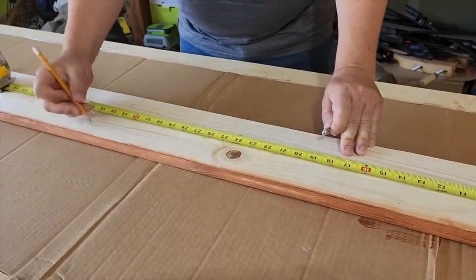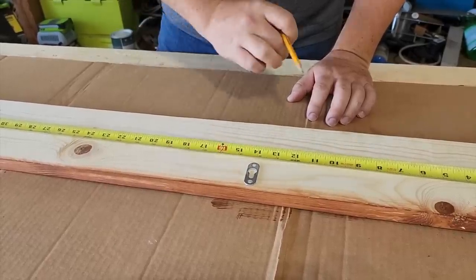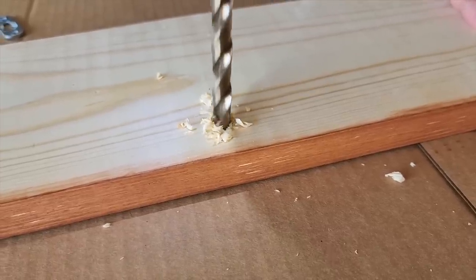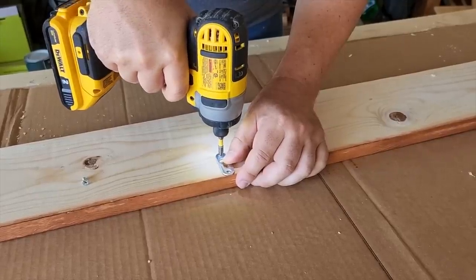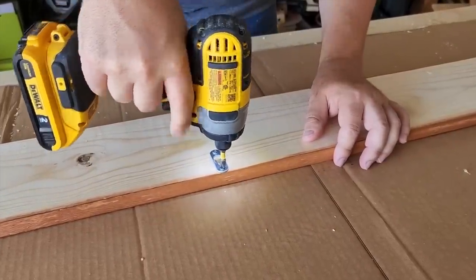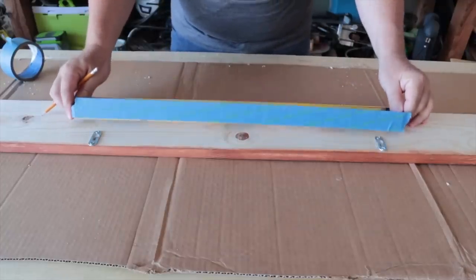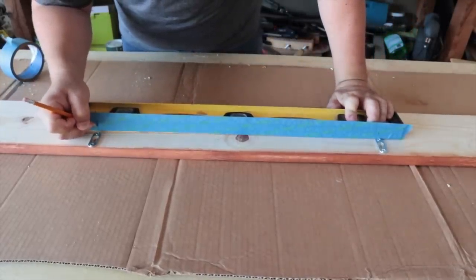The next step was to put the hardware on the board that would hold it against the wall. I wanted the board to be flat and not sticking out like normal hooks or hardware. With this hardware, you go ahead and mark it on the back of the board and then drill it out — that allows the screws in the walls to go flat inside the board and holds it up steady. Once you get it drilled, get rid of the sawdust and install the hardware using the screw that comes with it. All it takes on a board like this is two at each end. To hang it level every time, take a level, put a piece of tape across the top, lay it flat right where your hooks are, and mark right at each hook. Then set the level aside and use it a little bit later.